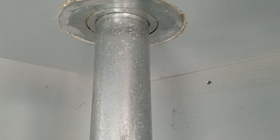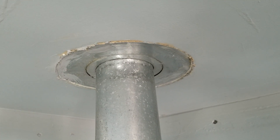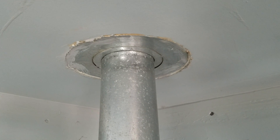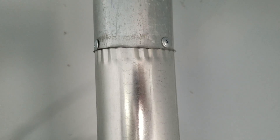We did reuse one of the pieces of pipe up top right here that was existing, going up into the single wall and up into the ceiling bucket. Your dual wall B vent in the attic is pushed up about an inch and a half into the cavity, which is incorrect. I can't change that because you're boxed in up top — your roof is like a 6 and 12, very steep roof. It's sealed, but it should be pushed down. That vent extending through the roof flashing should be pushed down because right now this pipe is shoved up into there about a total of three inches.